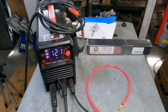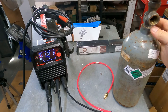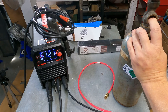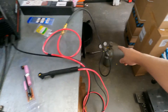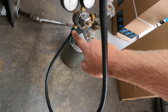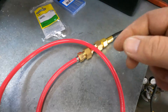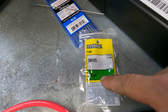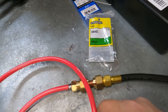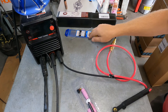I'm doing aluminum so I need 100% argon. I'm not sure if stainless steel requires 100% or if it can be mixed. I picked up one of the smallest bottles available — it already feels a bit light and I'm worried it might be leaking. After hooking up the regulator, I connected a quarter-inch pipe thread nipple with a hose that came with the welder, then got a 3/8-inch swivel adapter from the store to connect everything.